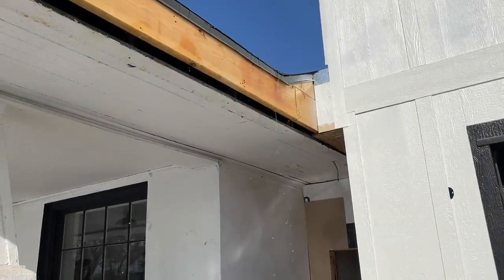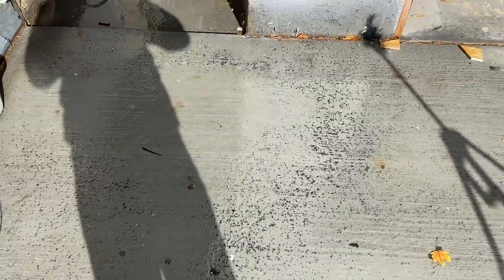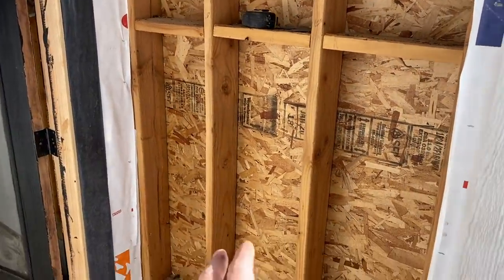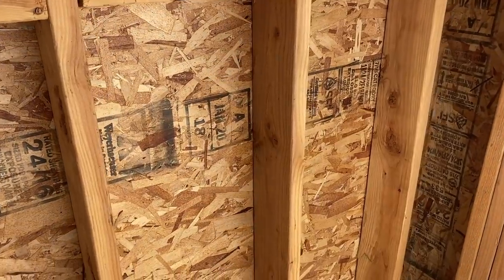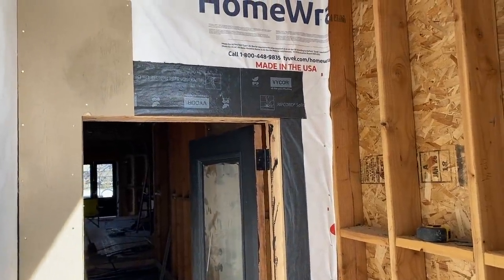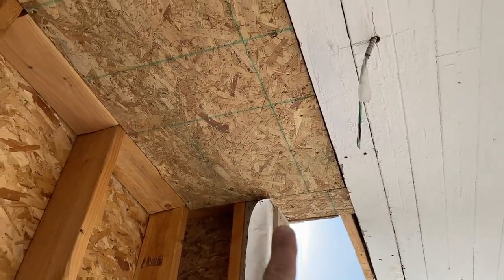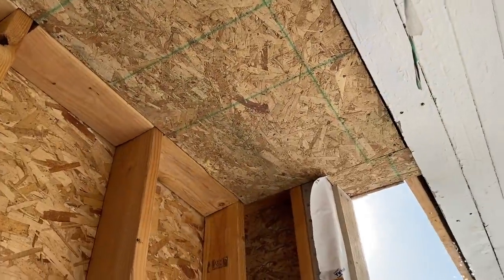Snow melt is dripping off — you can see right where I'm going to need to have my gutter system in place so that I'm not dealing with a ton of water right here as you try to get in the entryway. Right now I'm putting the finished siding on here, and we're going to get this door wrapped up. I'm going to run some electrical through here that we need to do, then close this off — it's going to need to be insulated as well. I might leave that open for the four-way. I've also got beadboard right here. I saved these boards from back where we tore off the old addition and the mudroom, and I just need to fill those in, so we'll see if I can get that done today too.